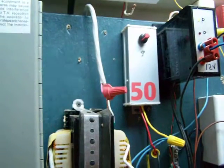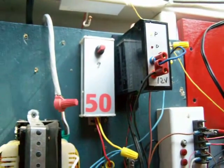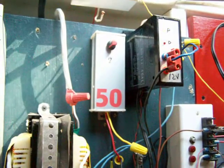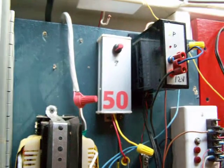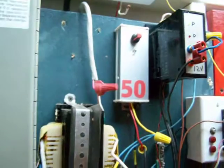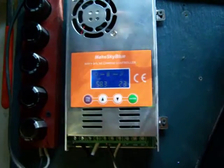This is my other buck converter. I had three of these running in the system and now it's down to one. This other little black box is a PWM off my 12-volt panels — you know, everyone's got a few of those legacy things. Never buy 12-volt panels or 24-volt panels. I'd buy a defective one of these in a heartbeat and modify them up for my purposes.